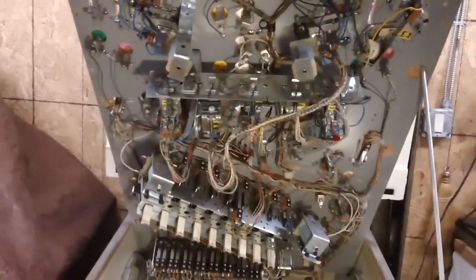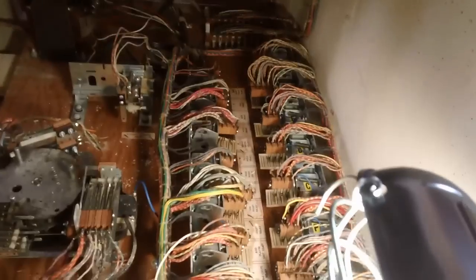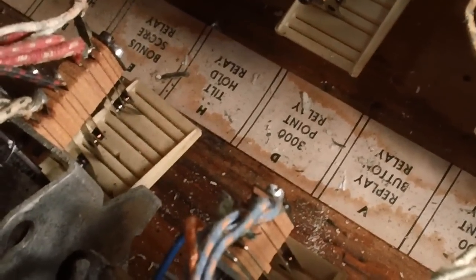So we've probably only got about 50,000 sets of contacts that need to be cleaned — long-term. I do see something that is a little messed up. See these little white plastic things? Look at that one right there — it's a little out of whack. I'll have to take a look at that; that may be part of our problem. Zooming in — yeah, that thing's all messed up. It's supposed to be lined up with the different relay contacts, put into different slots. That might be our problem — I'll start there first.